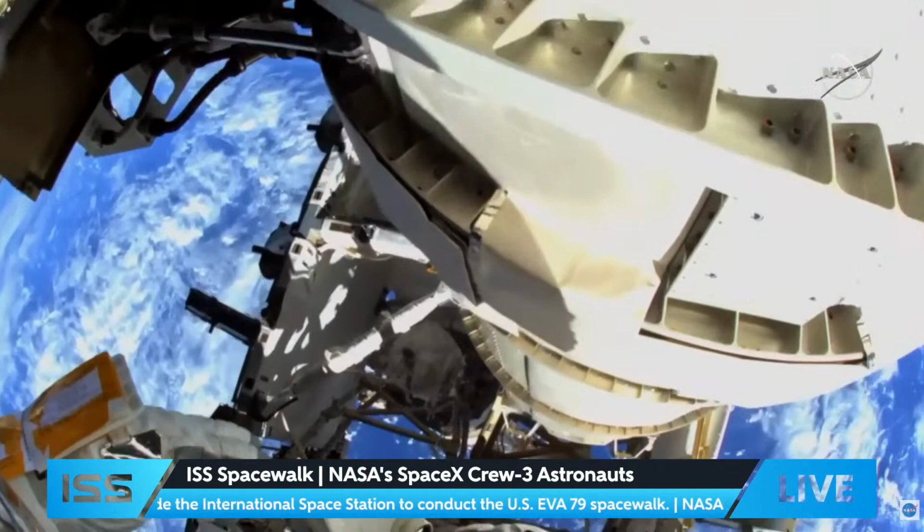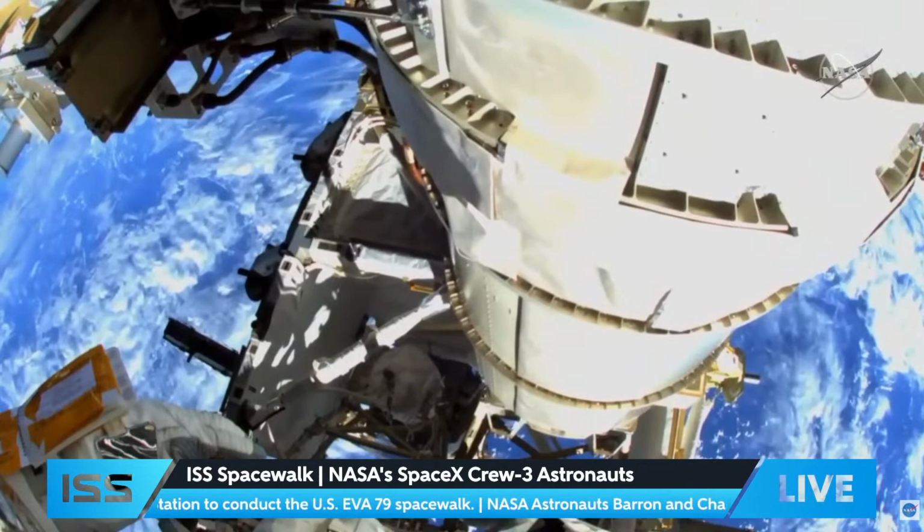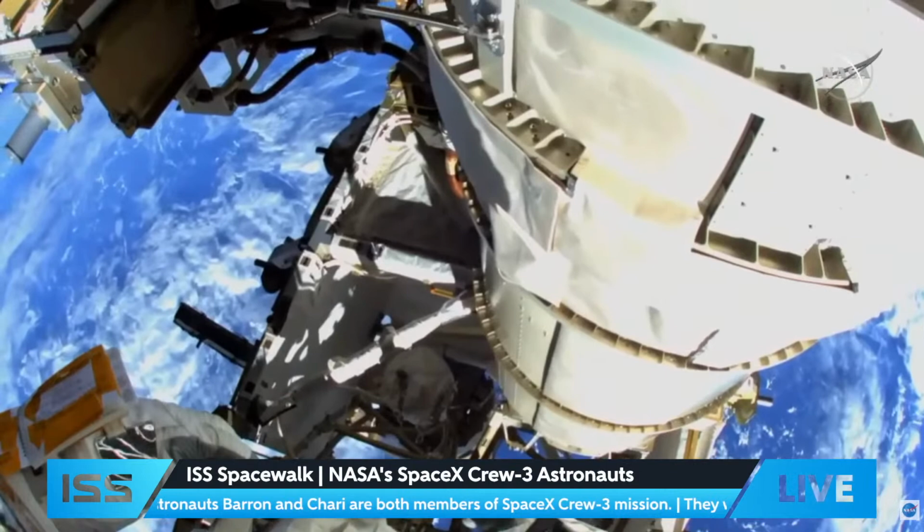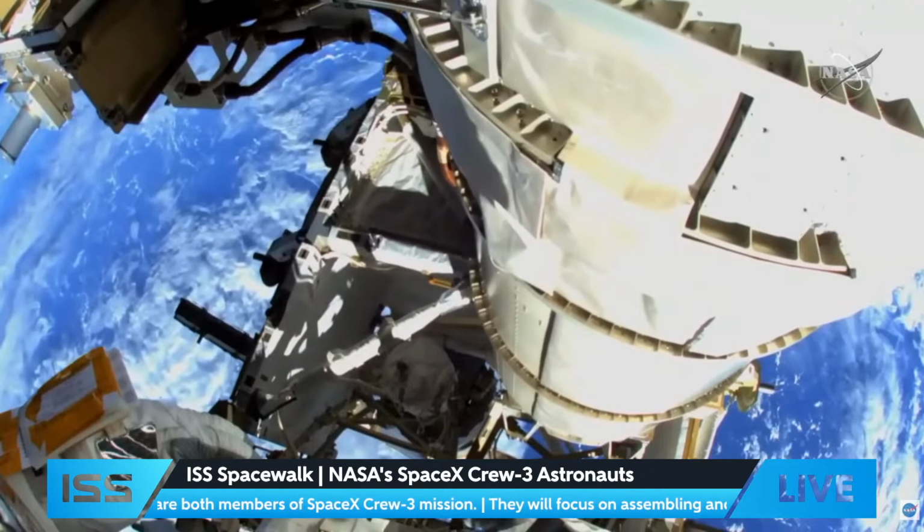And Raja, while you're up there, no sudden moves on the mass canister or the mod kit. Move slowly on the BGA. And maximum lateral loads are not a whole lot, so be gentle up there. Avoid cyclic loading and do not impart forces into the mod kit struts when not fully installed. I'll give you guys a call when it's fully installed. And battery and adapter plate cables on the IEA are potential snag hazards.